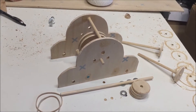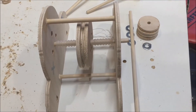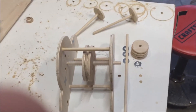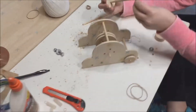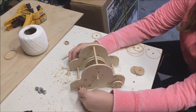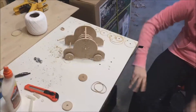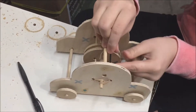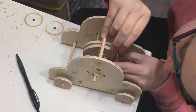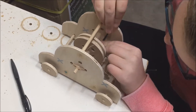Here it is with the three support pieces holding the two body sides together. She has it all glued together with some wood glue, and you can see the plastic straw pieces holding the center pulley in the middle. She tried a few different methods to add rubber bands — first a pencil, then an Allen wrench, and she ended up using a paper clip. She had an issue with the rubber bands breaking after three attempts, so we took it apart one more time and tried filing and sanding the holes a little bit, just to try and make it flow a little smoother.